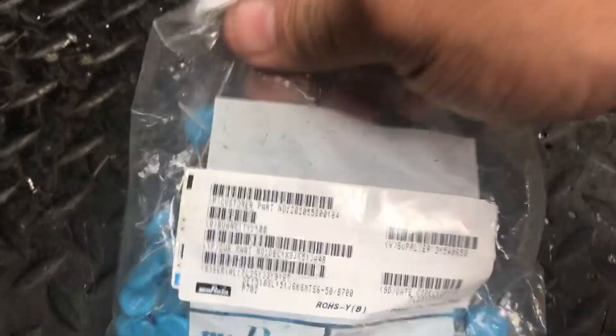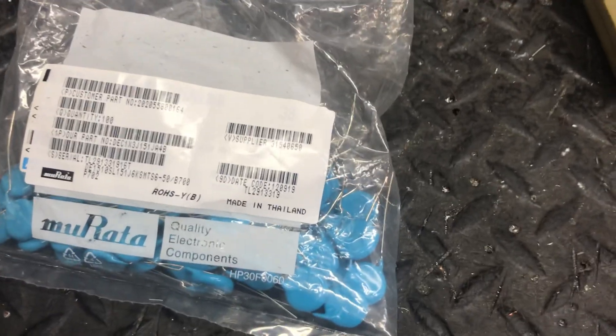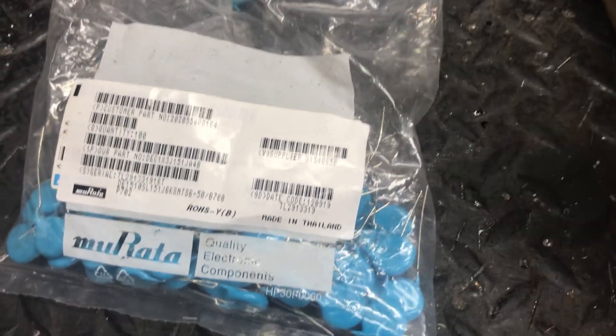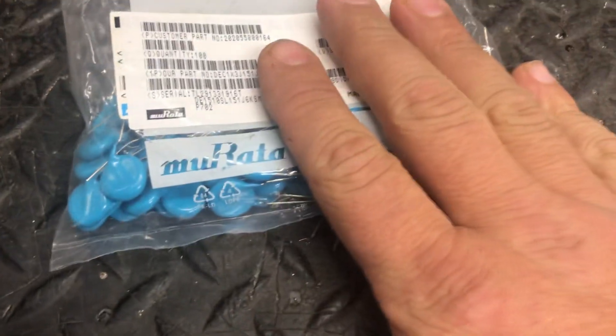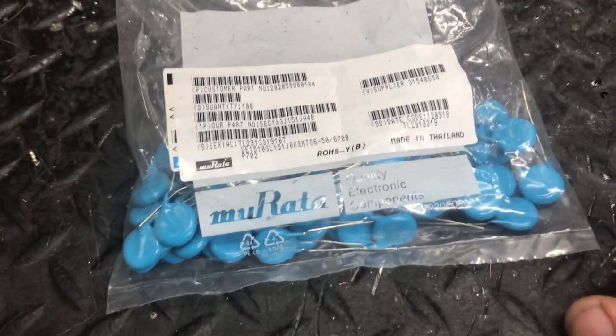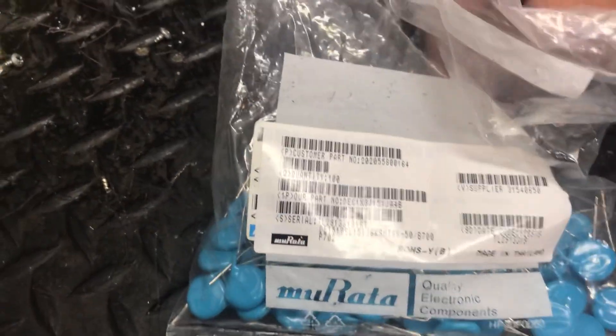Now there are places where you do want to use a silver mica — like on inputs and outputs on transformers, or swamping caps and so forth. There are places I won't use silver micas. But as far as these right here — these 150 puff caps at 6 kV running on the tune of my four pills — these are the best thing I've found. The ones with the five-dollar caps blow on me all the time.